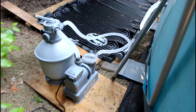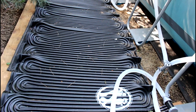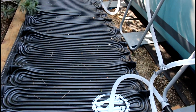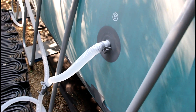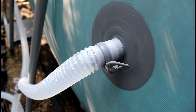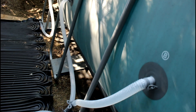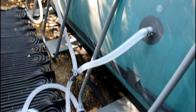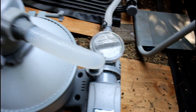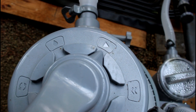I have my filter and solar heater on the back side here — it ends up in the sun all afternoon so that'll work. I just didn't want the solar heater on the front side. For the filter connections, we just have those little hose clamps on there, the tubing goes right over the top of the little part that sticks out, and we have the two outputs from the pool coming down to the pump and then up through the filter.